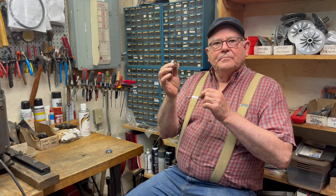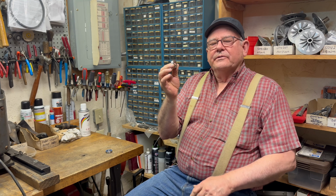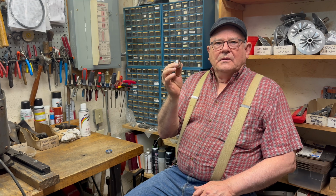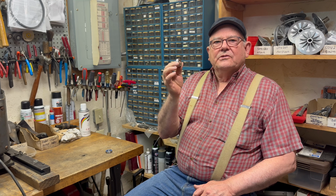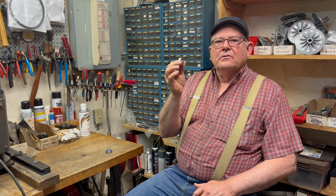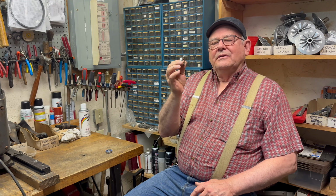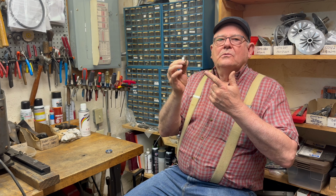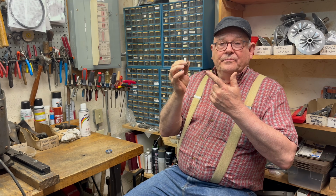The small gap in shielded bearings lets air in, and the grease dries up over time. This allows dust to make its way in and harden the grease. You will find at the end it's going to be like driving over a bumpy road, and if it's real bad, it's going to lock up so that you can't even turn them. Well, after long enough time, or enough bearings fail, it burns out your motor.